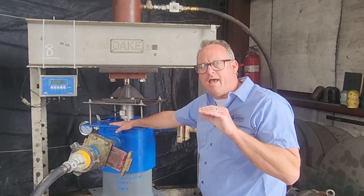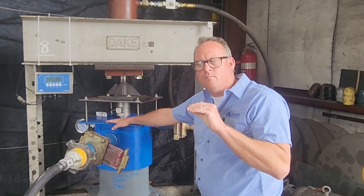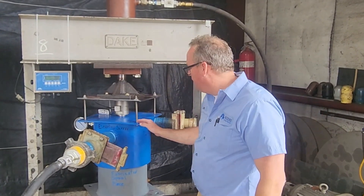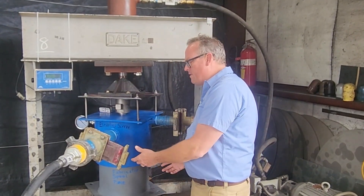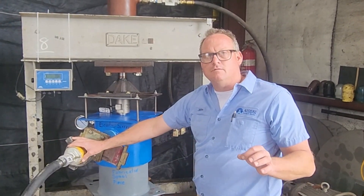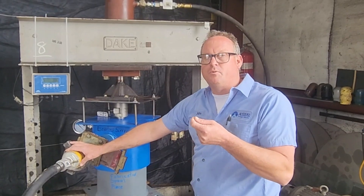There's an embedded cast-in-place steel plate, 24x24, on all but one row of the dock that we're talking about. This would be welded to that prior to pumping the grout. We'll utilize a pressure gauge on this valve to demonstrate when we've met our design force requirement.